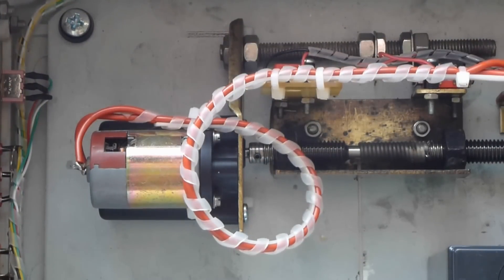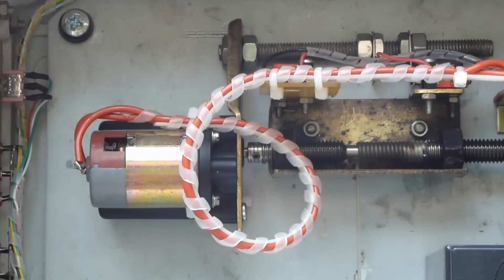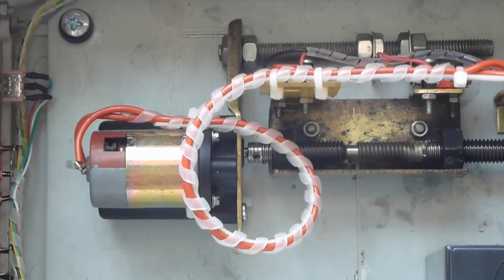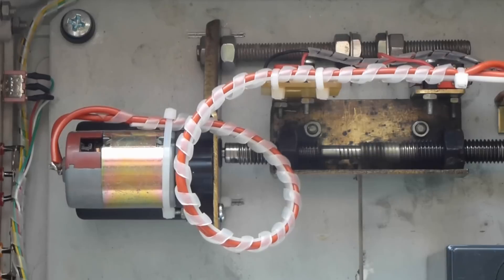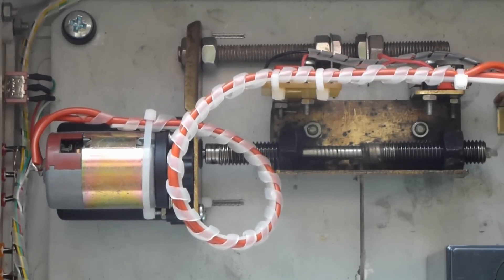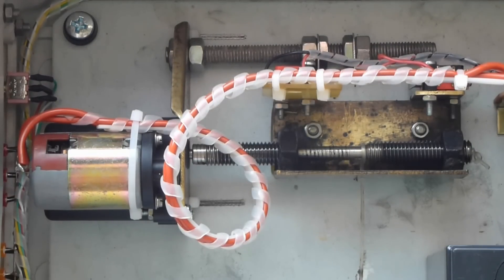It'll make a lot more sense. I'll close the door now — you'll see the motor turn. The cord will be kept under tension by the weight of the door. At the bottom the limit switch operates and shuts off the motor. When it's closing, the motor doesn't have to work very hard at all, so its current is limited by a resistor.